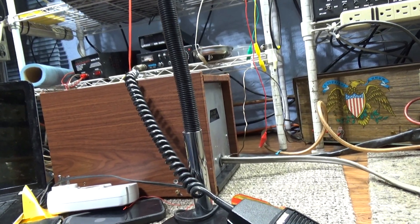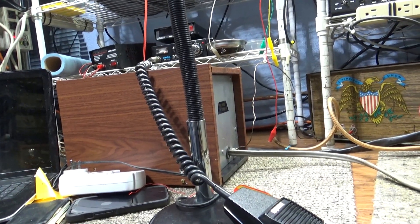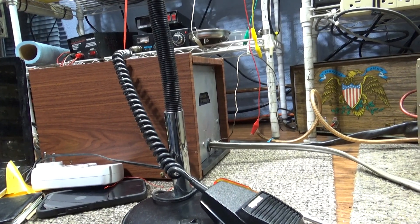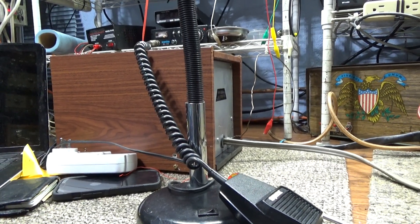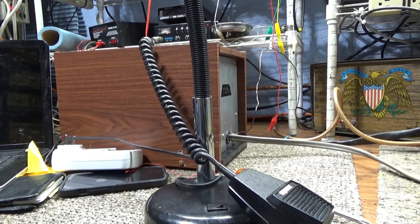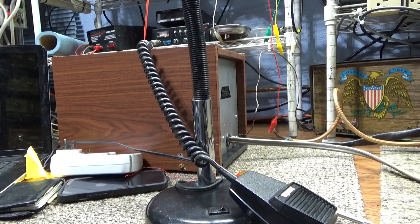I'm using a RayTrack 2000 clone power supply head because I got these amps with no power supply. The RayTrack 2000 actually came out before the Drake L4B — so does that mean Drake copied the RayTrack? Anyway, it's almost the same pinout and the same kind of plug, so I just hooked it up to the RayTrack 2000 power supply I had and away it went.